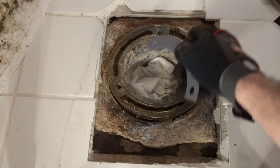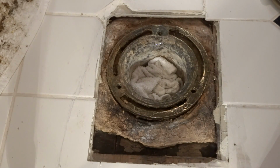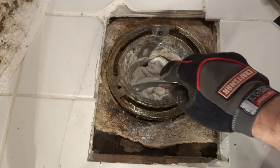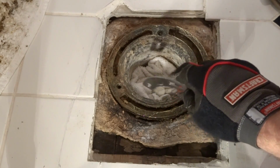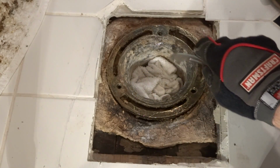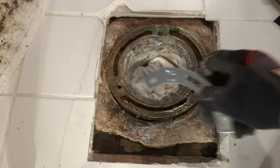If I can't bolt these, or if there's not much material underneath directly next to this to secure the flange to the floor, I need to make sure the toilet doesn't rock. So I'm going to take a screwdriver and try and pry the lead away slightly from here. If it were cast iron, I could probably heat up the lead that was in between the cast iron pipe and the flange, but in this case I believe the lead pipe was hammered around the inlet against the flange to hold it in place.